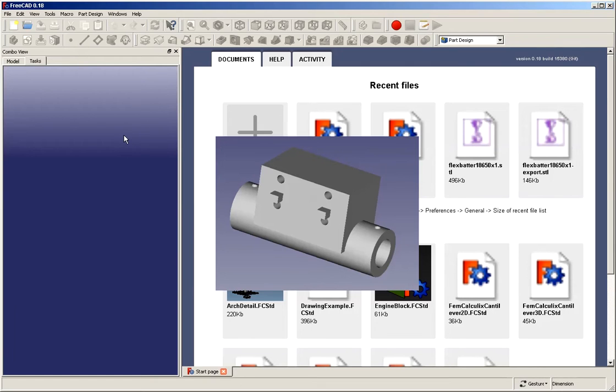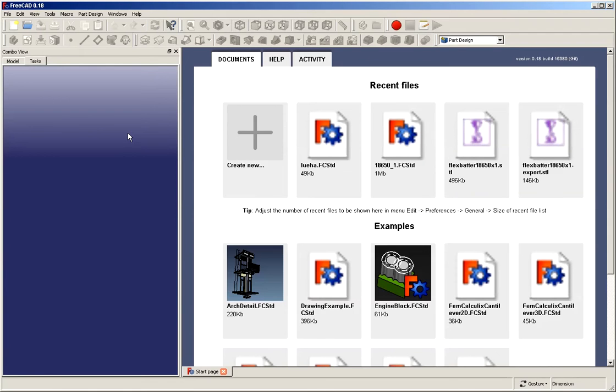The little project which we're gonna work on is a Y-axis holder. This allows me to replace the Y-axis fixture of an old printer that is using simple plastic bushings. That allows me to use Igus RJ4JP bearings, which are well known for good and smooth movements on the steel axis of 3D printers. That is the fixture I'm going to create.